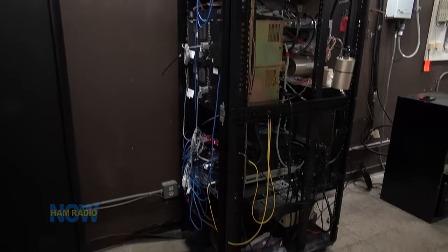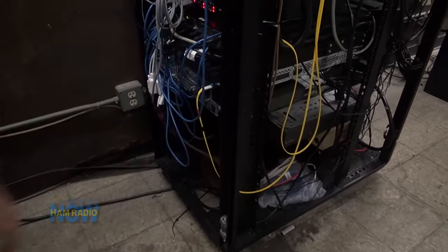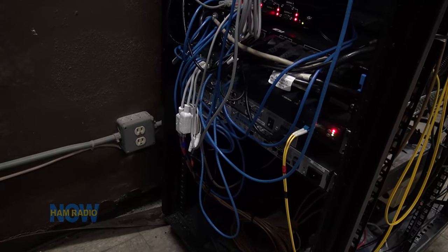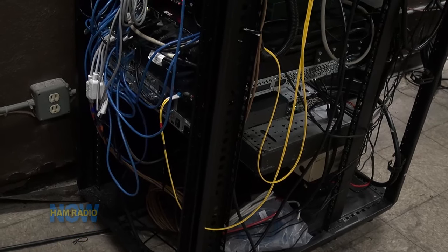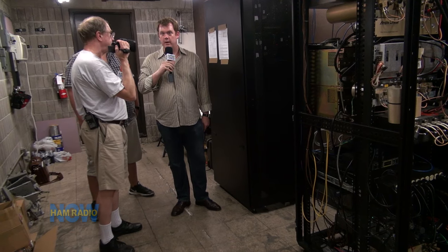So what do you have here in the equipment room? Everything up here is analog repeaters, but the heart of the HamWAN system is this busy device at the bottom — an EX4200 switch and router. You can see the white dongles with the little green LEDs — those are the power injectors. The radio connects over Ethernet and power goes all the way up to the radio on the roof. There are no radios inside here at all, just Ethernet switching. That yellow cable is our fiber going downstairs to a data center, which is how we get internet access and announce our 44-net address space.